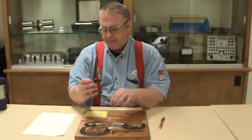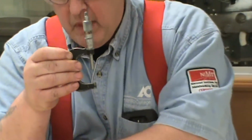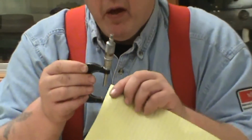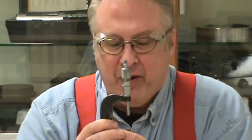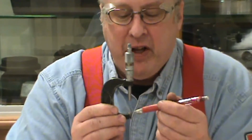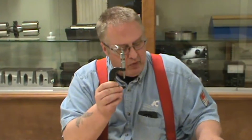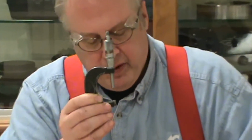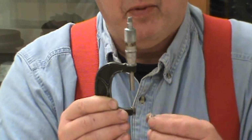This is important. We're going to go to the little bit bigger micrometer. Again, I'm going to clean this with paper. I didn't mention it before, but do not use any form of abrasive cloth. Do not use Scotch-Brite, a file, anything that can cut or abrade. You do not want it. These are very, very precision machines, and if you were to use emery cloth on that, you'd just ruin your micrometer. So clean with a piece of paper, not with a piece of Scotch-Brite, not with some old shop cloth that you've just got done polishing a shaft with, because that's going to really help you out.